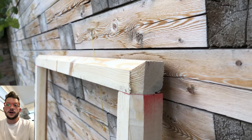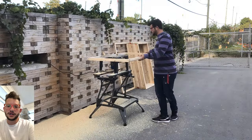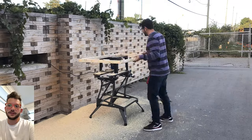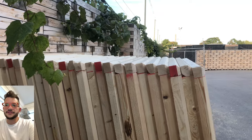This kicks up a lot of sawdust and is very messy, so it's always nice to do this outside. We're going to go ahead and get all 24 of these done — two passes for every single length of wood on each frame. Once all the frames are done, we make sure to sand away that small lip or any cut marks left by the router bit. There are all 24 frames routered and ready for sanding.